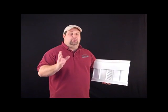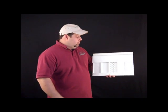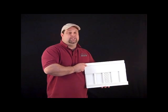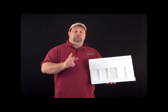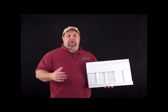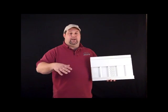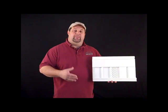Once you've measured your perimeter, you now know how many running feet you have. The next measurement we need is a height measurement. We want to measure from the ground right to the top of the existing skirting. We want to take that height measurement in six places — all four corners, and in the center of the two long walls. The reason we do that is because not all sites are even. You may find the home is 24 inches off the ground in the front and 36 inches in the rear. Take all six height measurements by the inch, add them all up, and divide by six.